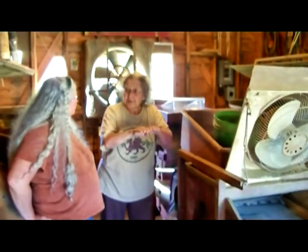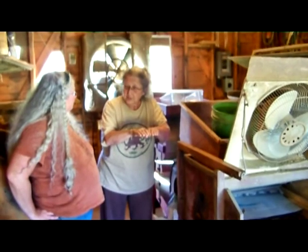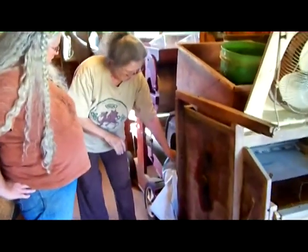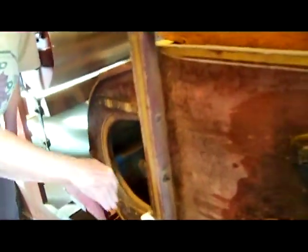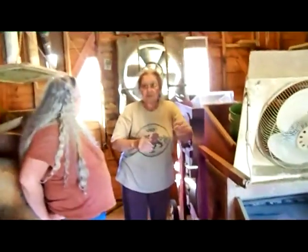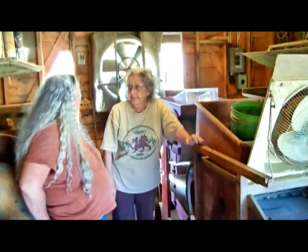We'll push it out where the chaff and the windsock is and let it rip. The screens jiggle from front to back and from side to side so that the grains fall through. This barrel on this end has paddles and creates wind that blows over the bottom screen, pushing the hulls and dust out of there. Then we'll bag it up and put it in our vaults to keep it safe until you come pick it up.